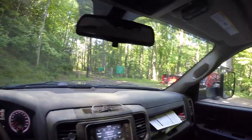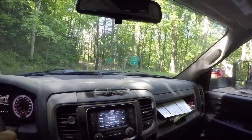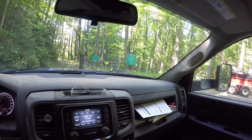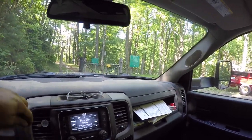I've got an excavator here. We're getting ready to take it down in there. And we have to go down here, and we're going to drive some telephone poles and try to stabilize a washout around a culvert over a slope. So we're going to drive these poles in, and then we're going to put riprap against the poles and then try to pack the dirt back and get it to stay there is the idea.